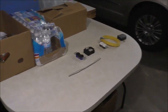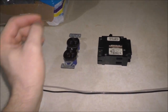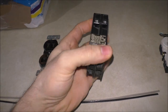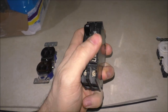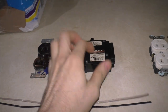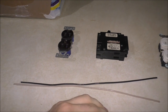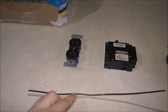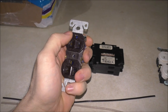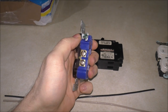Let's talk about breakers and outlets. This first item is a single breaker housing with two breakers in one — this is a very old 15 amp breaker with two separate breakers. It's not for my GE panel, just an old vertical style. This is 14-2 wire — scrap leftover. Normally your cable has a hot, a ground, and a neutral. This outlet here is a 15 amp outlet — that's your ground, that's your hot, that's your neutral.